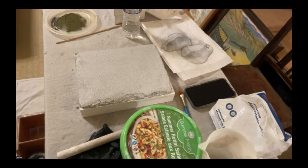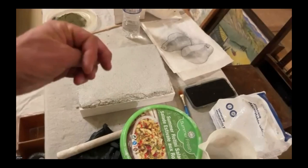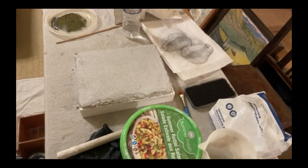And of course, it's very important to use the proper kind of sand that you mix into your lime to make a good strong plaster. If you look at masonry sand under a microscope, you would see all the particles are very sharp and angular. What that means is that when they are mixed with lime and crushed together, all those sharp and angular particles will lock together. Whereas if you use sand from a beach and look at the particles under a microscope, all the particles are rounded, and that's a bad thing because there's nothing for them to grab and your plaster will be weak. Oh, wow. Thank you. You're welcome.